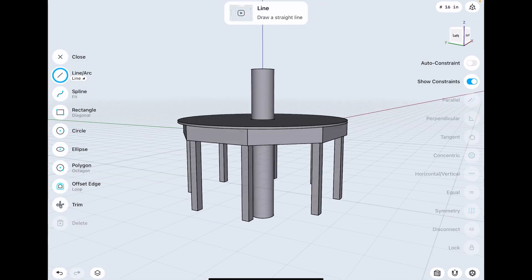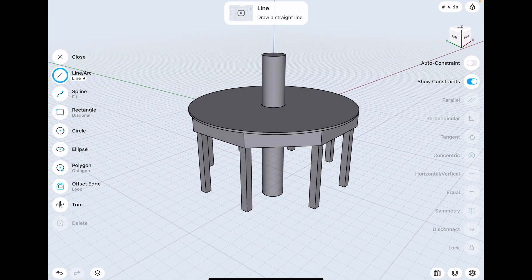Here's my design — this is kind of a top view. I really strongly wanted to make my deck circular. The reason is I don't have any pop-out bays on my observatory, so my NexDome is going to be a perfect circle. When rain hits that circle, I really want it to fall down the walls and onto the ground. A lot of people build their NexDome on a square deck, but if you put a circular building on a square platform, the corners will collect water that will inevitably egress underneath the walls regardless of how well you caulk it, causing all sorts of problems. So I really wanted my deck to be the exact size of my observatory.